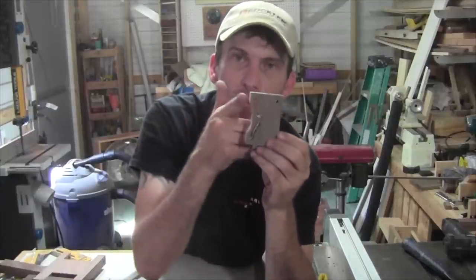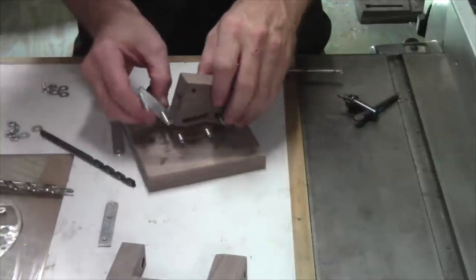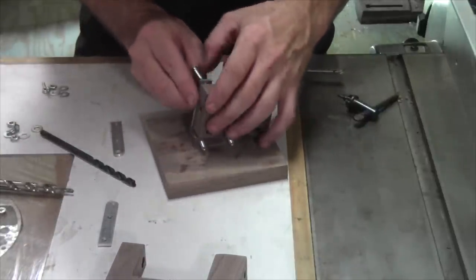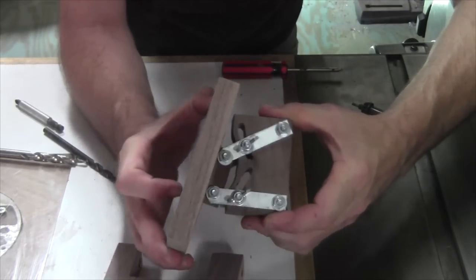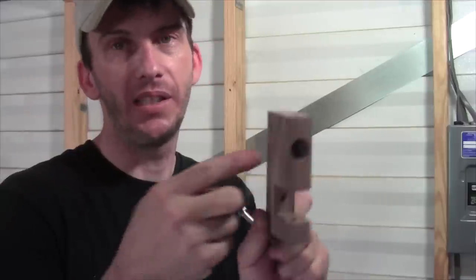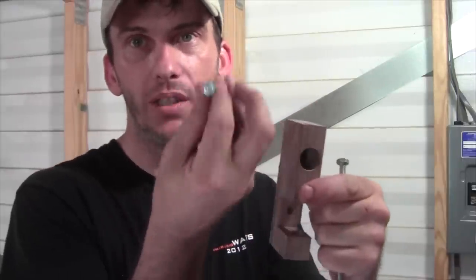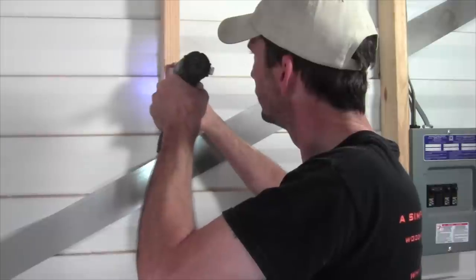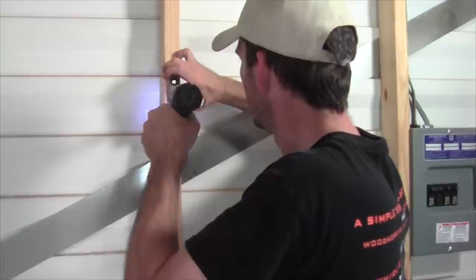This small piece is done as well. I cut a small swoop out here, leaving enough material on the other side of the slots so it wouldn't be too weak and will hold up well. I took some waste out so that when these two parts are bracketed together it's going to allow the head to pivot in a back-and-forth motion. To mount the bracket on the wall I pre-drilled some quarter-inch holes to use lag bolts. For the top one I'm using a four-inch by quarter-inch lag bolt to get a good bite on the stud. I used a Forstner bit to countersink so a socket could fit in and also to recess the bolt head so the top arm can pass it.